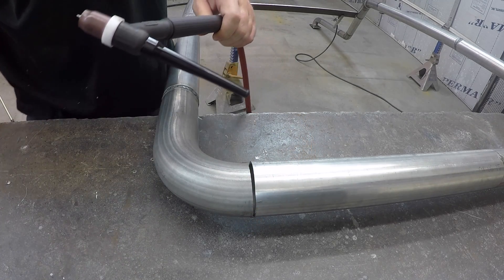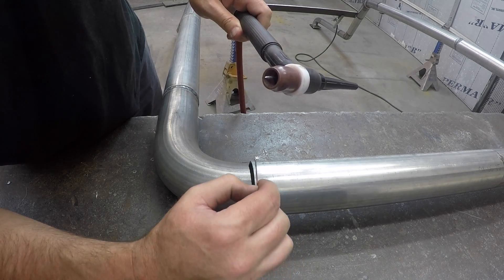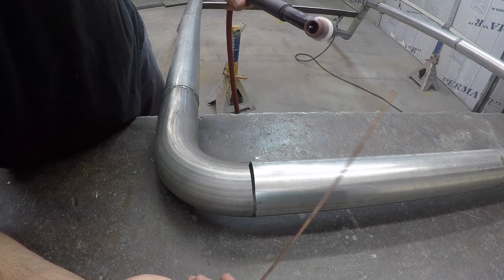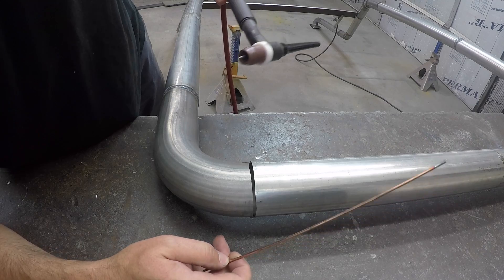So anyway, we're gonna try to fill this gap. First thing I'm gonna do is take a sixteenth-inch filler rod - obviously a bigger piece than this - and weld a little bead on each side of it. Then we'll take a 3/32nd - because this is the thickest I have right now - and bridge across it, then probably go back over it once we get it melted in, add a little filler, and make it look uniform.